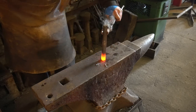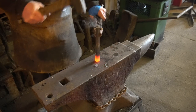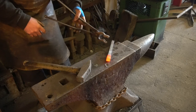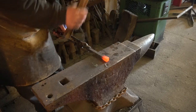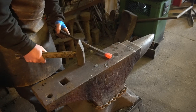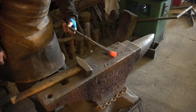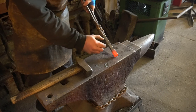I've got a little bit of heat left in this so I can do it again. If you rotate the bar a little bit it will help to minimise that bending on just a single side. I just want to straighten everything back up before I stick it back in the forge, and then I'll be good to do it again. You can see the bar's started to swell up nicely.